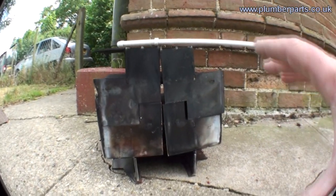Here we have the primary baffle area. Remember, most older boilers have baffles that are really just metal plates — usually about three of them at a slight angle: one, two, three. Then that flue gas goes off out to atmosphere, often at about 250 degrees flue temperature. This primary baffle section here is only the start of the heat exchanging possibilities.